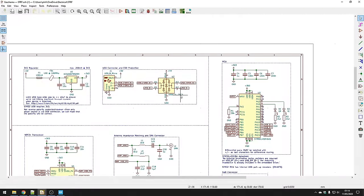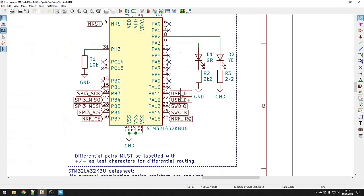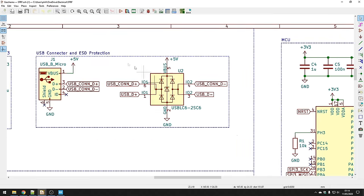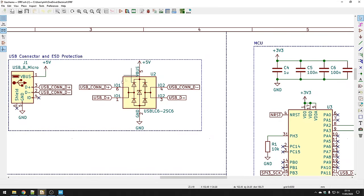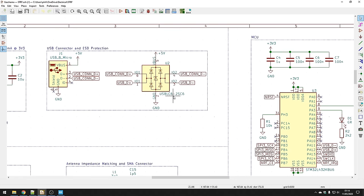Let's move to the USB connector. On the microcontroller we have the USB differential pair D- and D+, which goes to the USB connector — I've chosen the USB micro connector for its size. Just before the connector I've chosen a USBLC6 ESD protection chip, to protect against ESD. We'll have a lot of human contact when plugging and unplugging the USB cable, and humans can carry quite a lot of static voltage which might discharge through the PCB. This chip has loads of TVS diodes inside in a nice six-pin package.